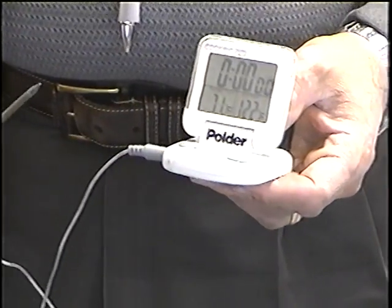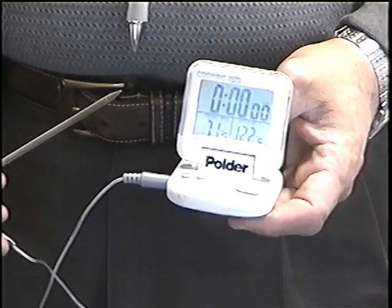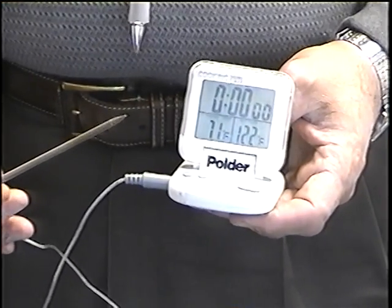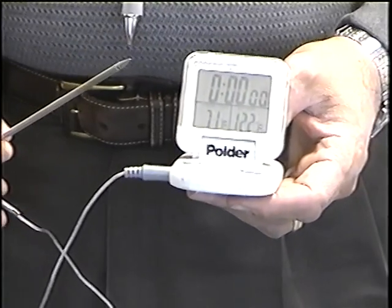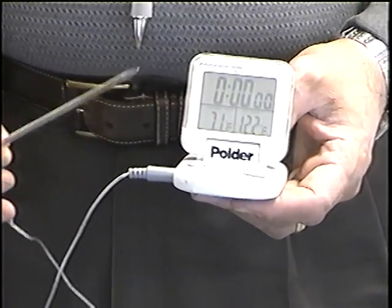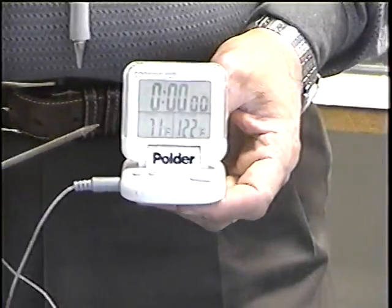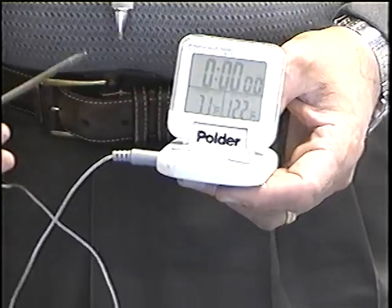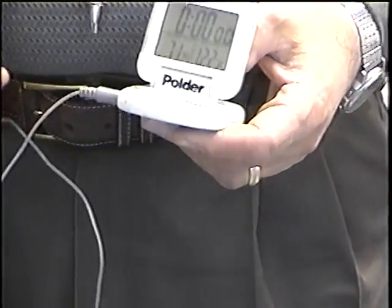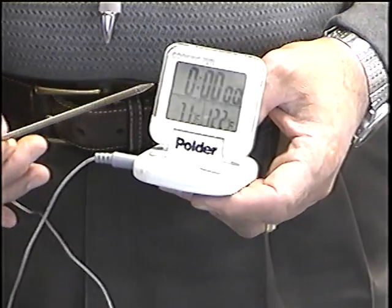Before you start making a rubber mold, the most important thing in the whole process is to make sure the vulcanizer machine is at the right temperature. If the vulcanizer machine is not at the right temperature, the rubber mold will experience softening, hardening, or shrinking